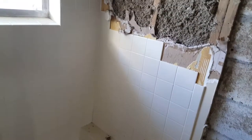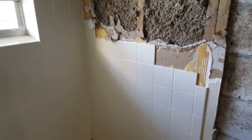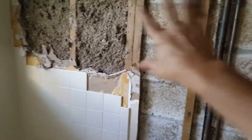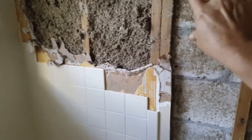All of this wall is coming down and we're going to put up Kerdi boards from Schluter. I love using these boards - I've used them before, it's a really great waterproofing system and it's code compliant. We're going to finish taking this wall down and then we're going to put the Reflectix - it's a type of insulation that has foil and air bubbles at the same time.